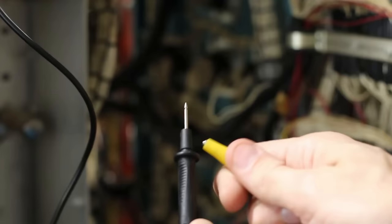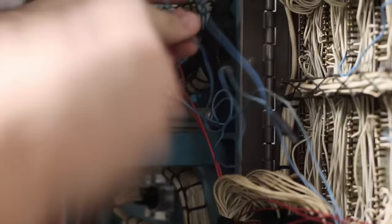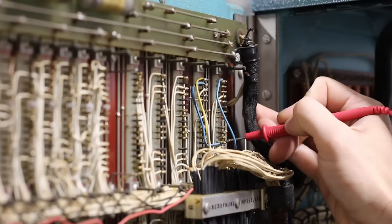Next let's trace out the modified wiring. I'll clip an alligator clip onto one side of a modification wire and hook it up to one probe of the multimeter. Then I'll follow the wire over to the other side and tap it with the probe to confirm a connection. Finally, I'll write down what connects to what so we have a full list of modification coordinates. Surprisingly, there weren't actually that many modification wires even though it looks like a lot — it mostly just required a lot of walking from one side to the other and back again. I'll put this list in the description below.